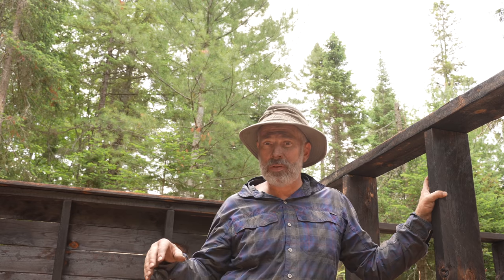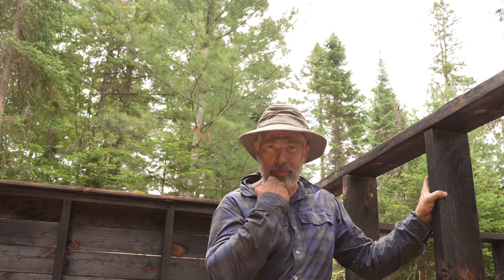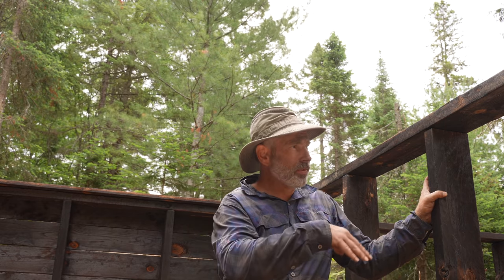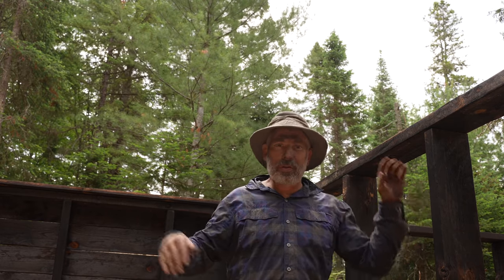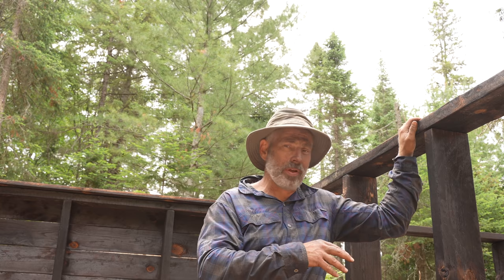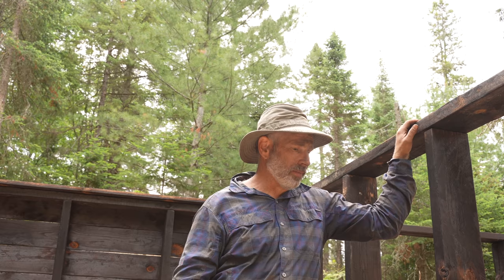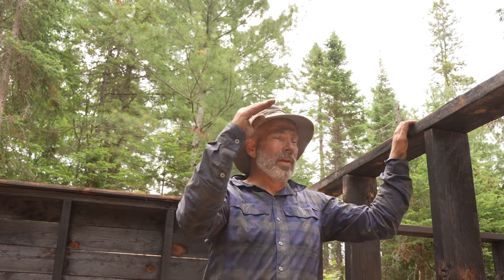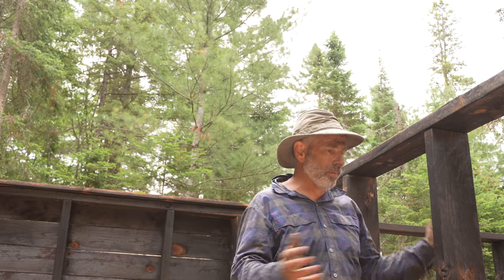This is my underground root cellar, which is also the foundation for the cabin. Rather than doing footings four feet down, I went four feet underground and built a basement. That's below the frost line, and then two to three feet essentially above grade, with a backfill taper. Having only four to four-and-a-half feet of soil against the wall means less soil pressure pushing in, and it gives me the height I want for snow load on the exterior.